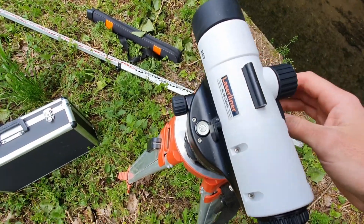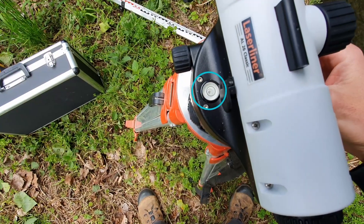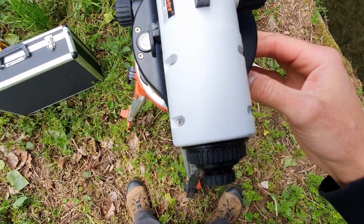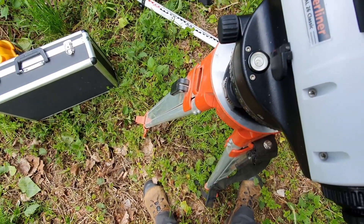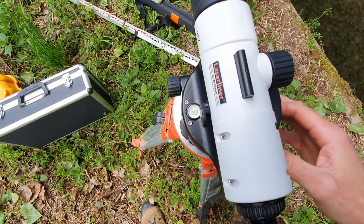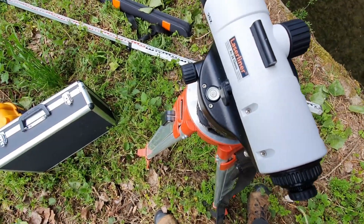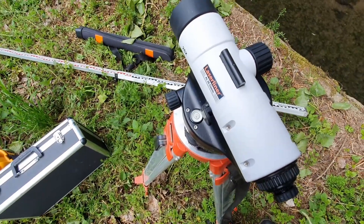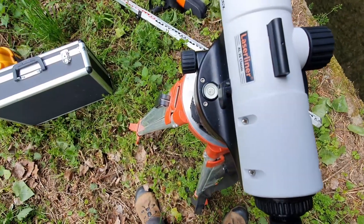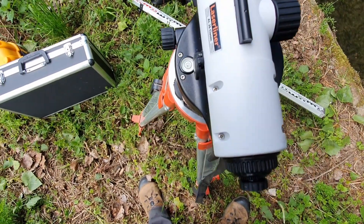When you're setting up your measurement station, just make sure that it's level. This is a fancy measurement station so you can make it level in all the different directions. It's not that important when you're doing these really small measurements because vortex turbines require very small height differences and not over a long distance, but you can always make sure that you do it right. You can see that the bubble is in the middle, and that means that it's level in all directions.